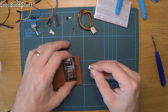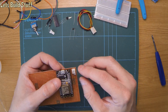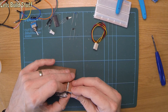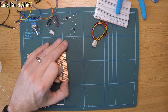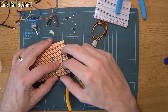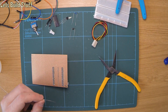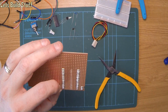Next thing to do is put this header on - I'll put it in that way around. I'm going to need to bring some wires up from the ground and the V in up to this end, but I'll do that underneath the actual device rather than trying to do it between there and the header. So if I solder that in next, I'll get a bit of solder on the top of it. I've just got one of them done - you can make sure it's quite flat. Get the other two done.